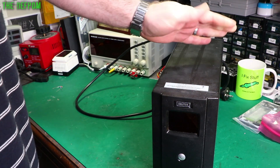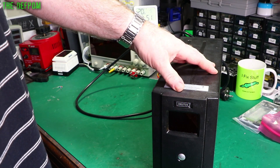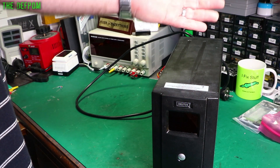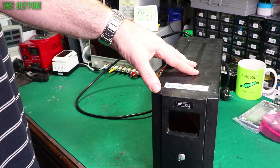So it was running. It's been plugged in a year and a half, maybe two years or something like that, just running in the background, just fine. And then it suddenly started shutting off. Because this is a line-interactive one, it runs all the time — it supplements line voltage. So if the line voltage dips, it'll bring it back up again to devices that are plugged into it.